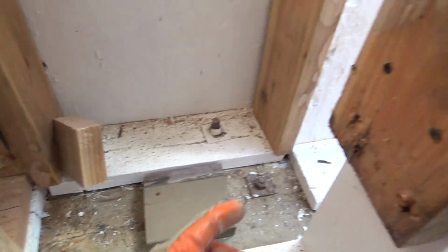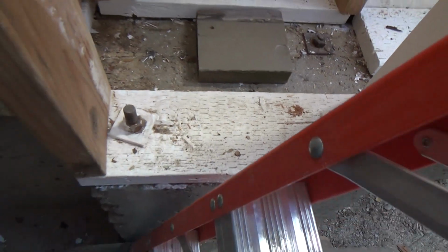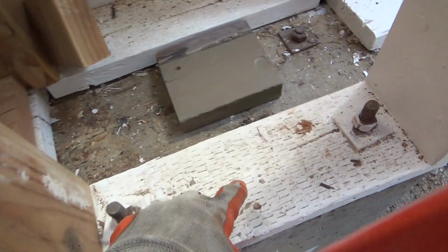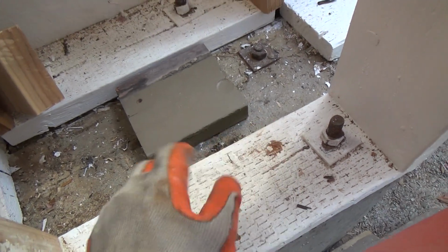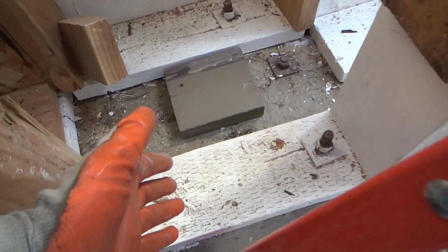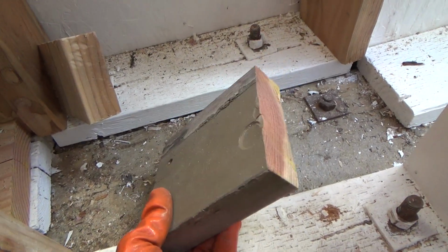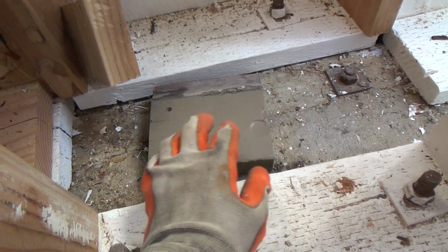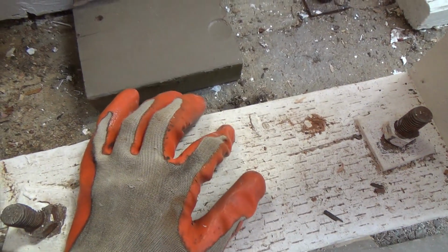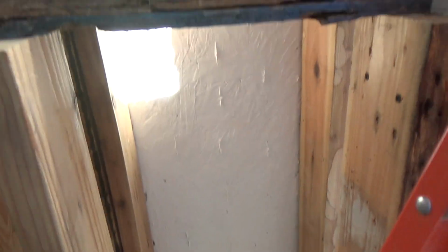You're not supposed to have Douglas fir touching concrete, and that's why this was mud sill. It was green before, remember? And I painted it, and it had all those lines in it because they dimple it, and then they saturate it with some creosote material, and then they make it so that it can touch concrete and it's not going to rot out. The other thing most people used to do is use redwood, but redwood is not as strong as this other wood here that they now call mud sill. Okay? Alright. Not that you wanted to know that.